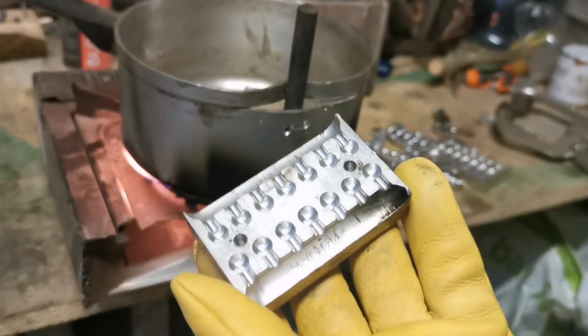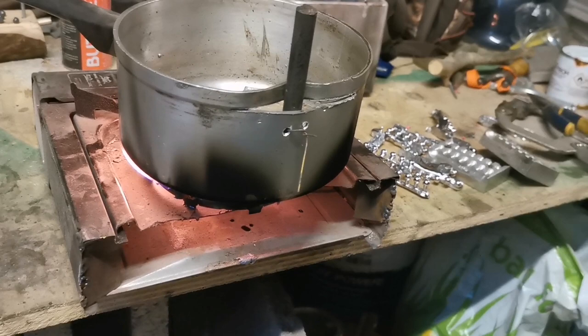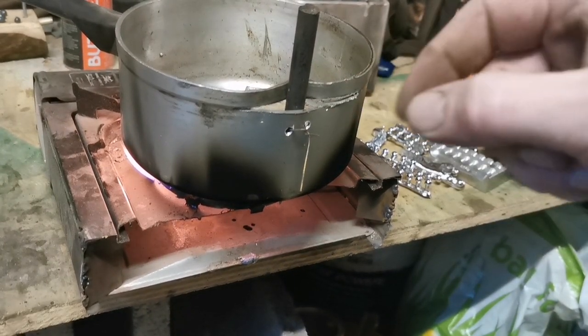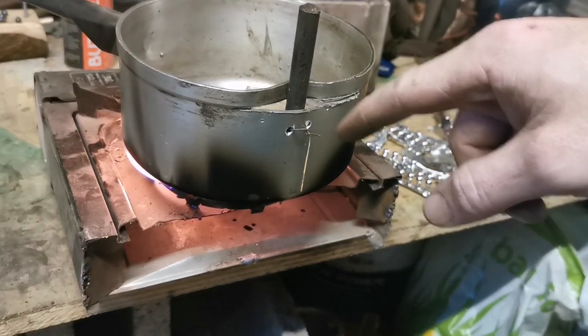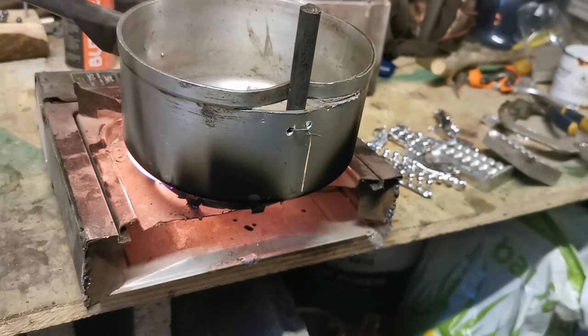So there you go guys — much easier than trying to ladle molten lead. If you take it from the bottom where there are no impurities, you'll be casting balls so much faster. You will literally be doing a few hundred in a matter of minutes with this setup. I hope that little pot setup will be of use to you. Only recommendations I have: the older the pot the better, the thicker the aluminium the better — modern day ones just don't hold the heat as well. Hopefully it's stuff you can have lying around the house, maybe in the shed or in the attic. It's definitely a much better way than taking it from the top. Thanks for watching and I'll see you next time.